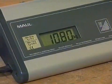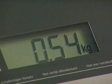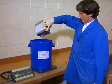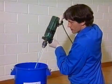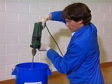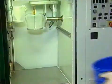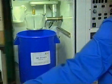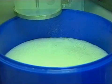The necessary amount of silicone, calculated from the mold volume, is weighed in a bucket and 10% hardener is added. It is important to note the time when the silicone and hardener were mixed together because this is when the pot life of 90 minutes begins. The silicone is mixed for one or two minutes using a mixing tool in an electric drill, and must be completely degassed, as all remaining gas pockets in the mold will expand under vacuum and affect the dimensional stability of the cast. The liquid silicone is first pre-degassed inside the vacuum chamber using the sawtooth function.